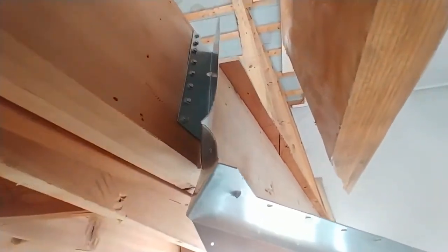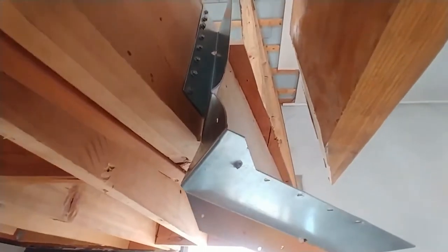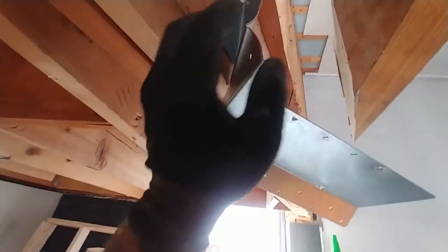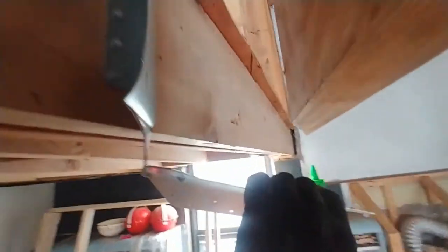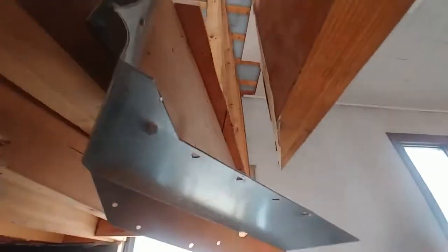And I thought I might reach in here with a hammer or something and bend that, shut that angle to start with, but instead I'm going to take that pressure off the clamps and let this come back. And then I can squeeze everything together with clamps and slowly cold form it down to where I want. Beating it with the hammer is just going to deform it and it'll look bad. I did have to really force it to get it to open up like this so that we can get this around, and then I'm going to swing this up and around again at the top.